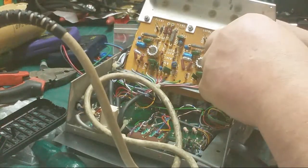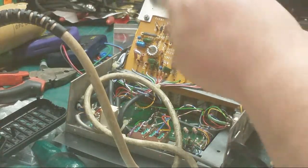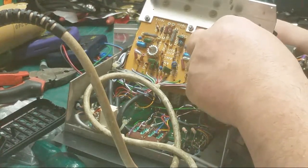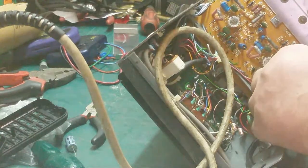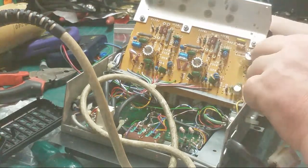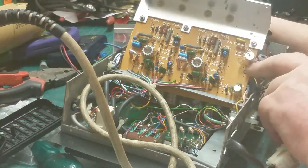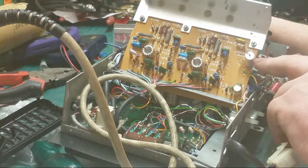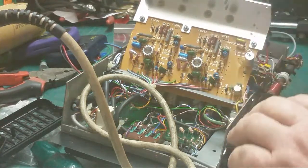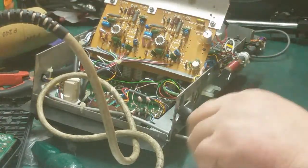And to be honest, there's our first suspect. Look at him. Oh no, that's just over that resistor, over that diode. There's then a diode. We'll check him. We don't need to worry about that, the reason being I've got the same value on the other board. Just check the bottoms of these. Yeah, they look okay.